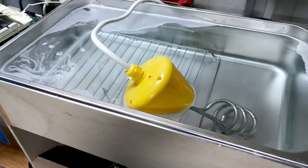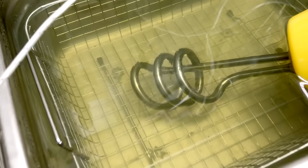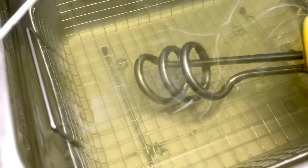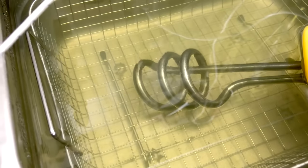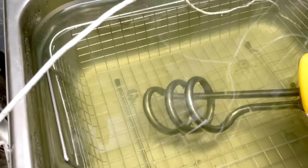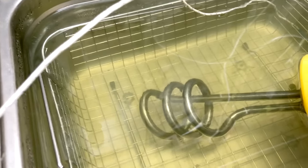During this first test, I also discovered how important it is to connect the tray to ground — failure to do so can result in an uncomfortable shock. The next thing I did was purchase an immersion heater. Although this doesn't give me thermostatic temperature control, it does allow me to get the liquid up to temperature quite quickly, and while the cleaner is running, the cavitation tends to keep the liquid warm enough. Just make sure you don't leave this heater unattended, otherwise you might end up boiling the thing dry.